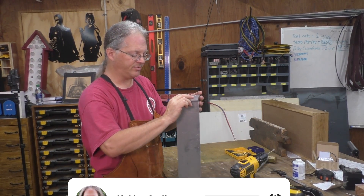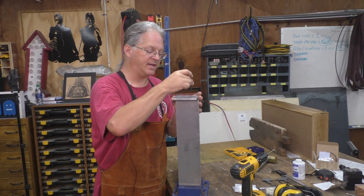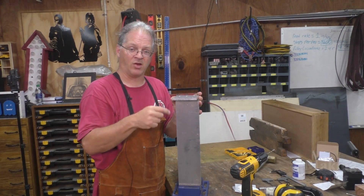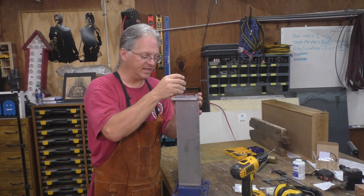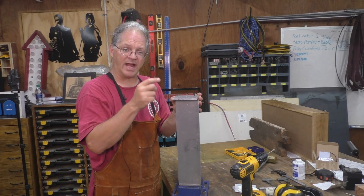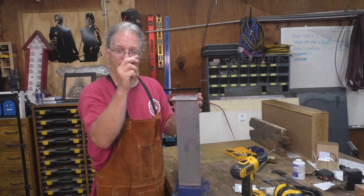So I've drilled my three holes here, and rather than just putting this plate on here, taking my transfer punch, and marking all three holes while hoping I don't move it around in the process, what I'm going to do is line up the line that I scribed on top with the center of one of these holes. When that's centered, I'll take my transfer punch, mark that one hole, then go drill and tap it. Then when I come back, I'll take a screw, put it in, and tighten it down, then line up the other two holes with the scribed line. The screw will act as a clamp — that's how I can get more accurate holes drilled, because I don't have a clamp that can hold this in the vise while ensuring it doesn't move during marking.